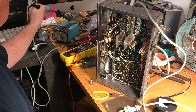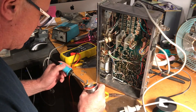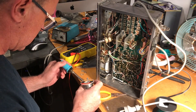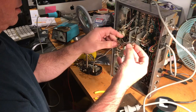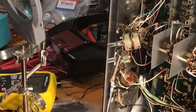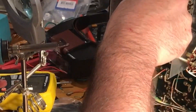The plan is to swap the wires one by one so we don't get lost. They all look very similar — there is a colour code on them, but they all look very similar. So by doing it this way we minimise the chance of getting confused about where each wire goes. We hold it in the same position and just go wire for wire, and hopefully that gets us a replaced potentiometer.